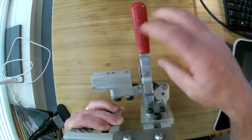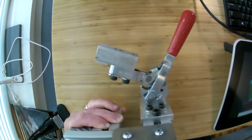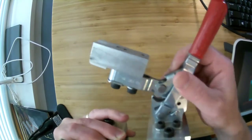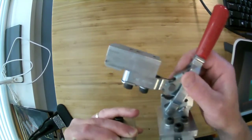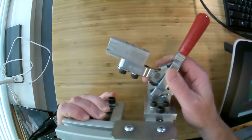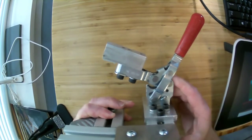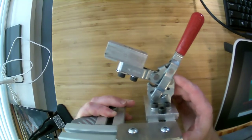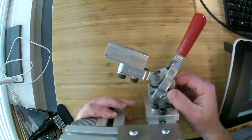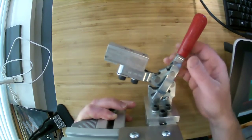Now these clamps have a lot of different connections and joints in them. And so, I don't know if you can hear that or not, but there's a little bit of compliance in there. I can kind of wiggle this clamp around. So this clamp would generally not be a good enough clamp for machining unless it were pretty low accuracy machining with fairly low loads. But it's a great kind of clamp to use for something like welding, which doesn't have very high forces in the welding process.